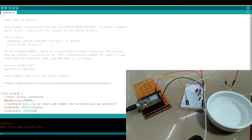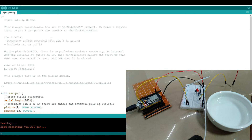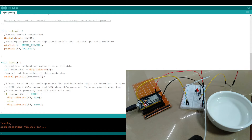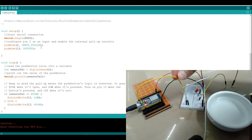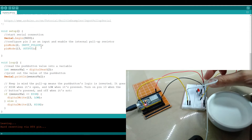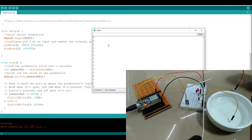Taking it to the next level, I found the digital input pull-up sample sketch in the Arduino ESP32 examples, under the digital section. What it does is output a one or a zero to the serial monitor based on whether there's a high or low input on pin number two. I've put a wire onto pin two connected to the low side of the LED. Starting the serial monitor, you can see we're getting ones, and when I put the wire in the water I get zeros — so the ESP32 can now detect water.